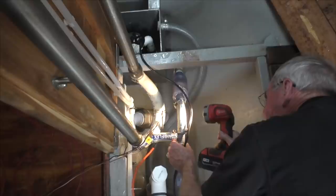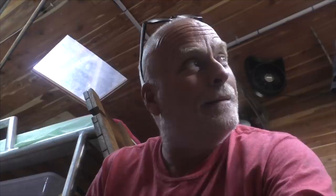When I stop pumping, water keeps coming because it's siphoning in from the river. But if you just move that over to the empty position, the empty position shuts off the water and stops it from coming in. But if the ball valve is shut off to the outside, how's it getting river water in here in the first place? It's hard to get this valve all the way closed without a wrench on it. So if it was open just a little bit and the hose was off when the pump kicked in, I was forcing water into the toilet - that's why the toilet filled up so much. You've got to use the crescent wrench to shut these things off. This is what makes most boats sink in marinas - a hose comes off, a bilge pump battery runs dead, and a sailboat goes down at the dock. The problem is people don't use their boats enough. You live on them, you come back from lunch, you find it.